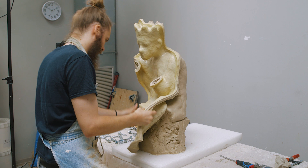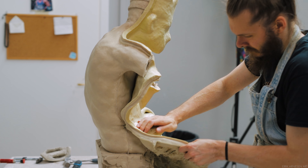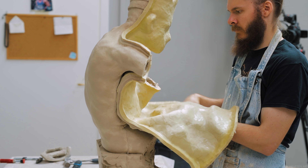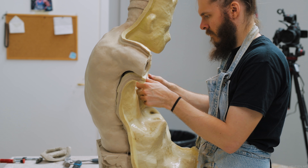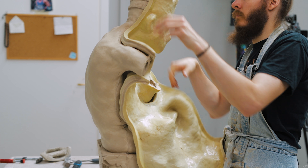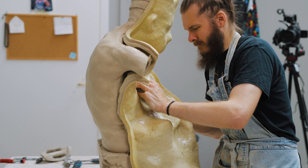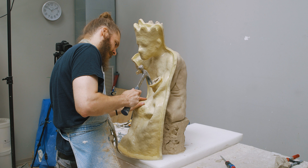The silicone folds away, and you should take care when doing so. Do not let the weight of a silicone piece this large go unsupported — it can tear under its own weight, which would obviously be really bad. I prefer to work from the bottom heading upwards, since the bottom of this piece is open, and then along the seams, slowly loosening up the silicone skin from the surface as I go.